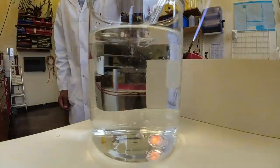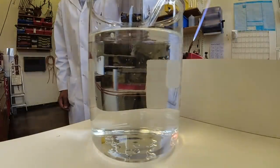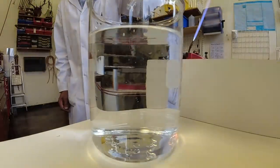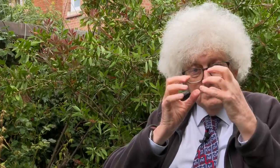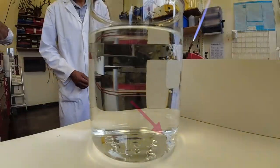And that lump is still very hot on the inside, but is cooling on the outside. And this difference in temperature creates big strains because as things cool down, they contract. So the outside is trying to get smaller and the inside isn't contracting. And those strains give rise to cracks.